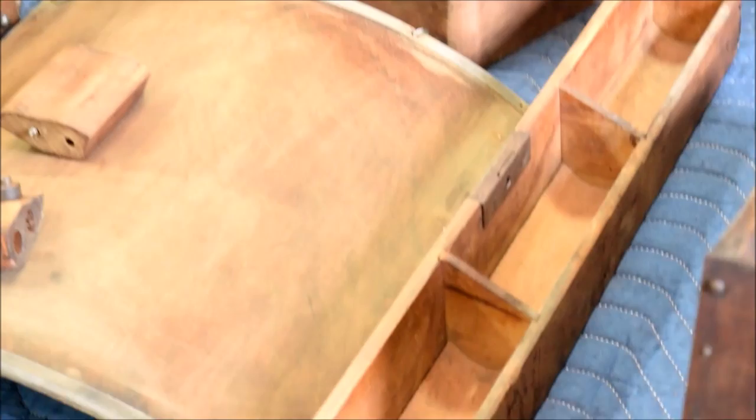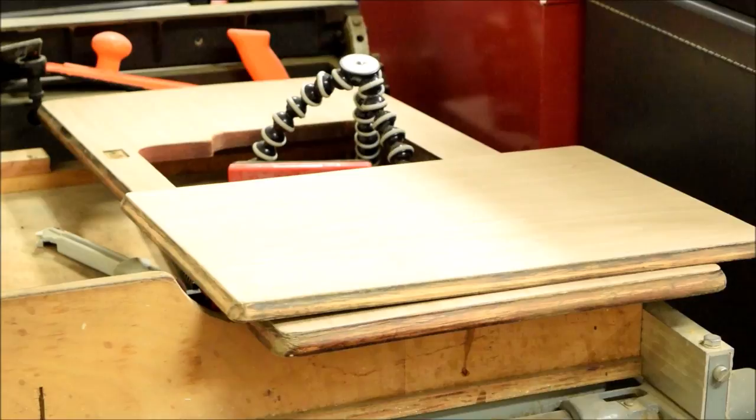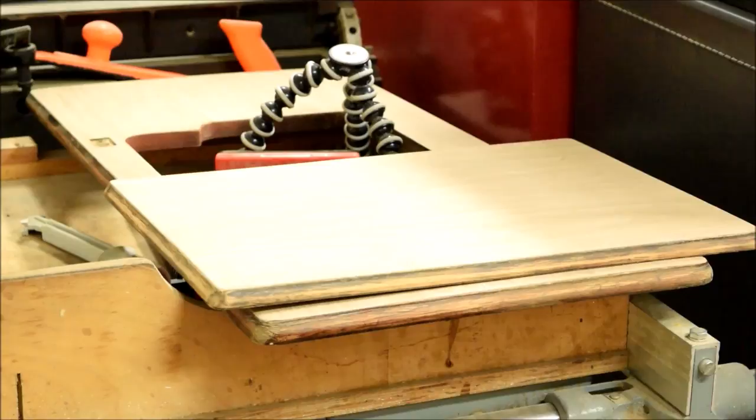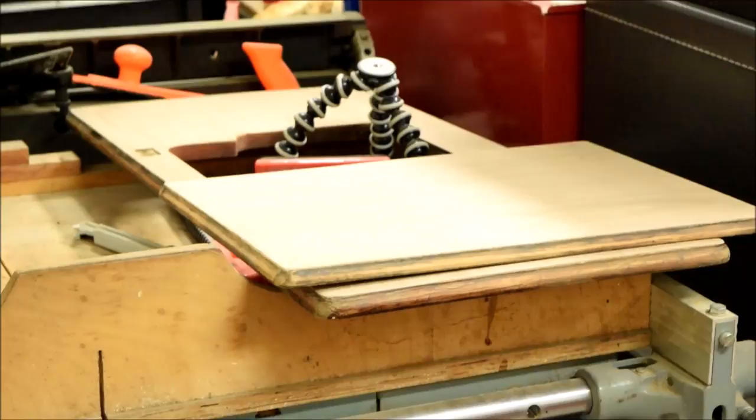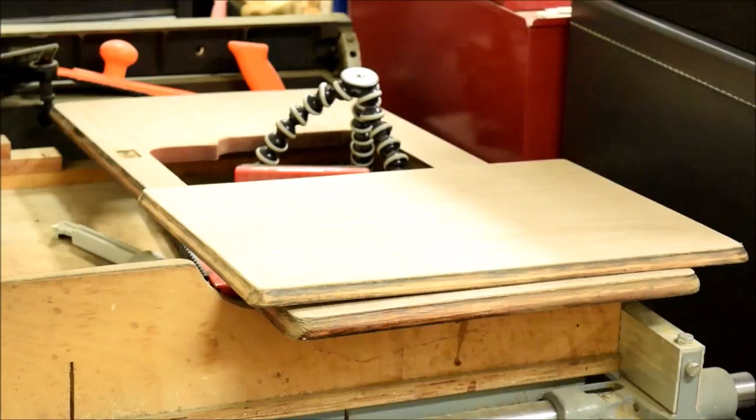On this second piece, which is the flip-up lid, you can see we had that big tear right there that had to get filled in. As far as the rest of it, it's all sanded down. This is the back of the cradle which has the original color on it — you can see it's got a lot of red in it for a walnut. So I've got a red walnut stain and I think we're going to put that on as a base coat. Over here is the lid of the main tabletop, and as you know, walnut is an open grain wood — we may need to use grain filler. If this veneer was thicker I would probably just use timber mate, but the modern veneer is very thin and I don't want to risk sanding through.